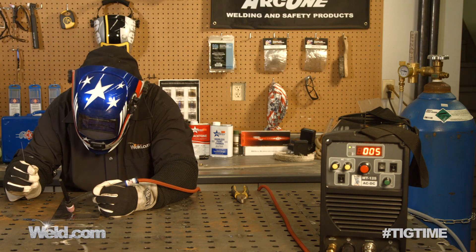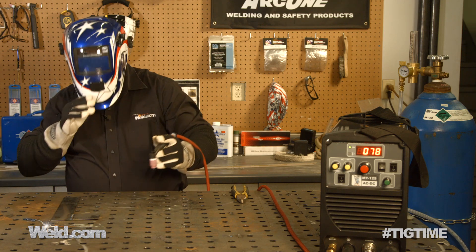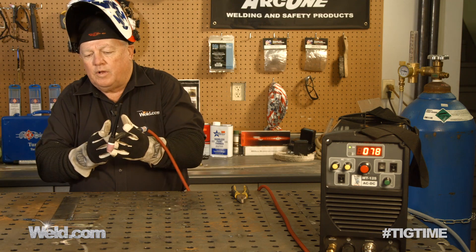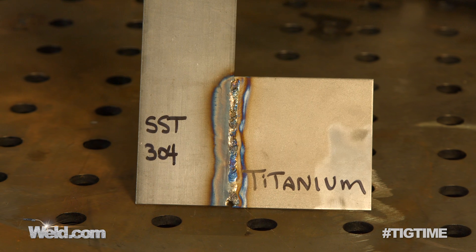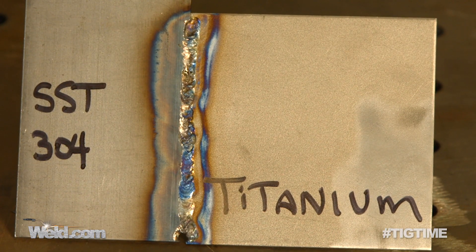You can really tell they're trying to repel each other, but I keep dabbing filler just to keep a common bond. It's kind of pretty bizarre looking, actually. So it tried to weld. You could see the two liquids mixing. I can hear some crackling going on. I got some blues and funny colors there. From a weldability standpoint, just visually, it kind of welded.